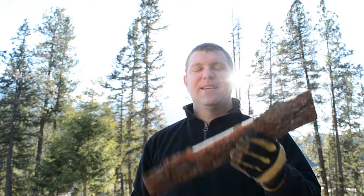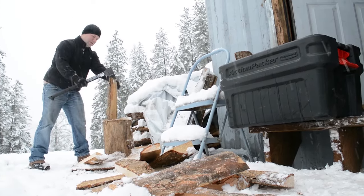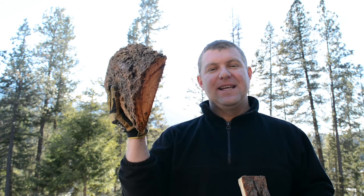Another tip: it can be tempting to put large pieces of wood straight into your stove. Some bigger stoves do really well with two to three large pieces every few hours, but our stove doesn't like big pieces — it can't retain enough heat to ignite them well. What we found is to take those pieces and split them into smaller ones, about the size of my wrist. If we put three to four of those pieces in every 30 to 45 minutes, it burns nice, hot, and clean.